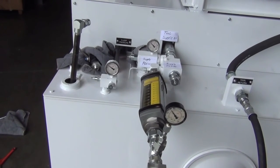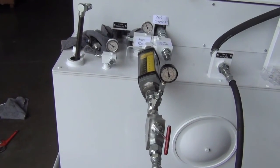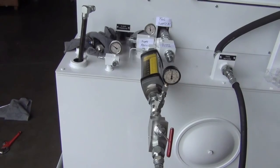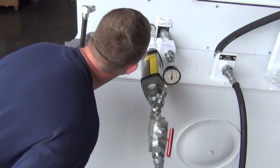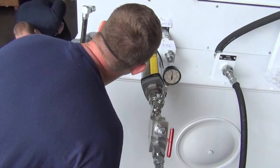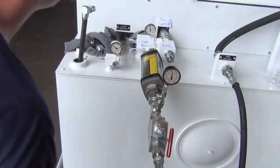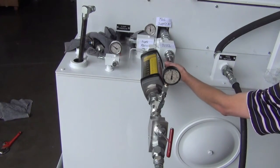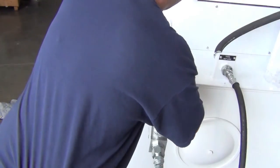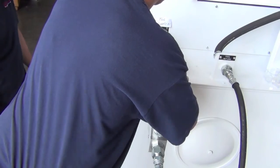We wanted to give you a brief overview of the tooling necessary to make adjustments to the DFR side of your circuit. The DFR compensator is installed on the larger volume tool pressure pump on your system. In addition to the components installed on your power unit, we've added a flow meter. Downstream of that flow meter is an additional gauge, and downstream of that gauge is an additional throttling device — you can see the needle valve with the red T handle adjustment knob. These are all necessary to measure the differential pressure across your speed control. If you need to make adjustments to the DFR side of your circuit, please give us a call.